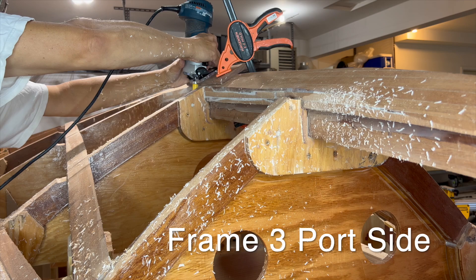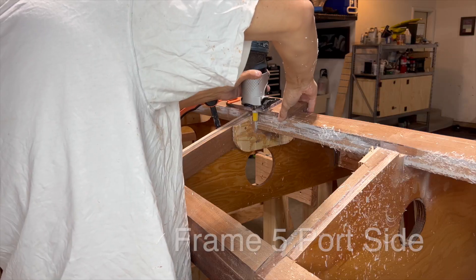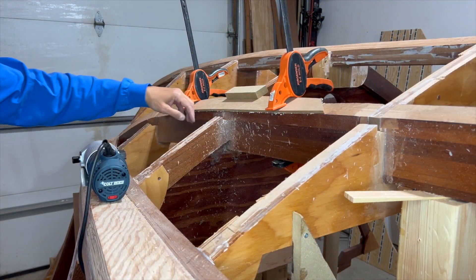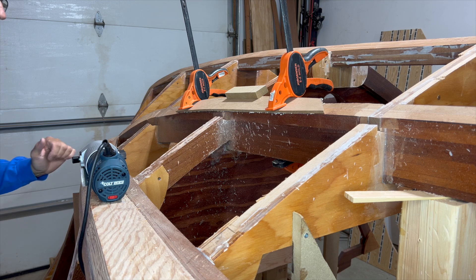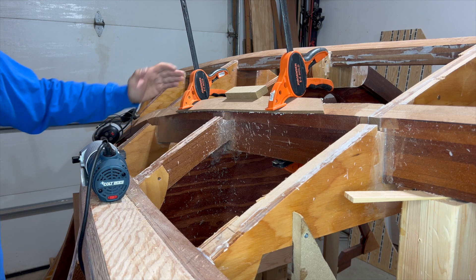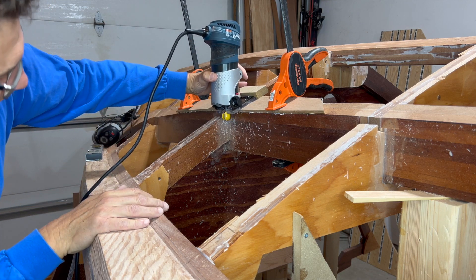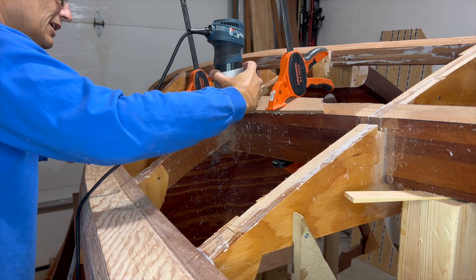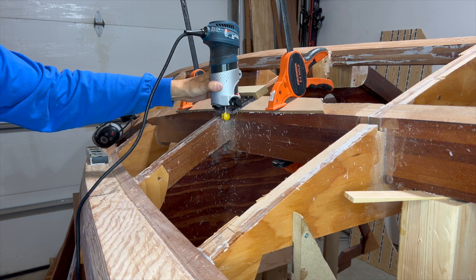In the end I found that the three-quarter inch bit worked better than the narrow one-inch long bit. I used the flush mount bit to clean this up and get a nice edge for the limber hole right up along the stringer. I've built this jig out of scrap quarter-inch plywood with a hard stop. The idea is to butt this up and have the round router bit come right to the edge. I've adjusted the router to be perpendicular when sitting on this, so it should come right in and clean out that edge to finish up the limber hole.